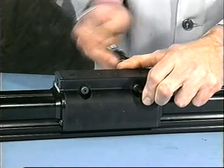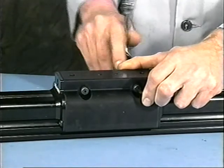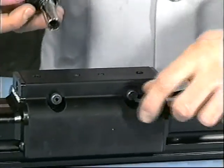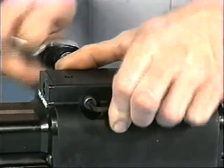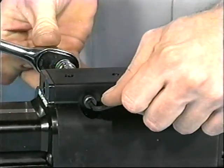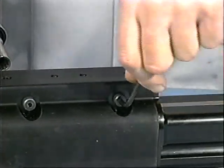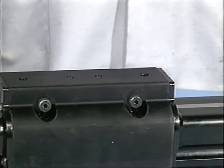Now, tighten the shoulder bolt nuts. Proper tightness will allow the bolt to be rotated with an Allen wrench, but not by the fingers. The tightness of the shoulder bolts will directly affect the breakaway pressure required for the carrier to move, and adjustment will vary from application to application. The tighter the bolts, the higher the breakaway pressure required. Regardless, the carrier should be able to manually move freely without hesitation or binding.